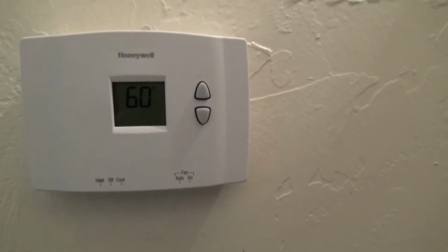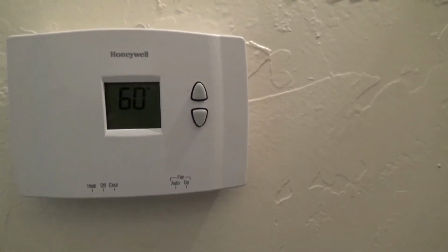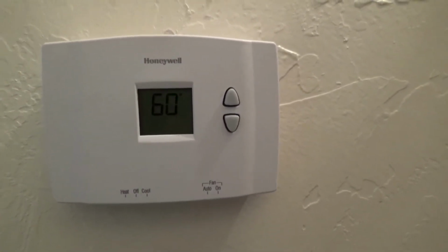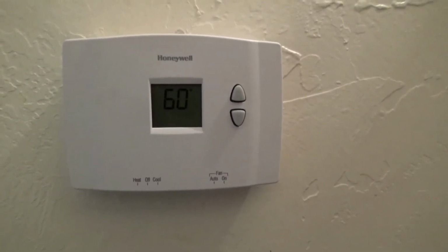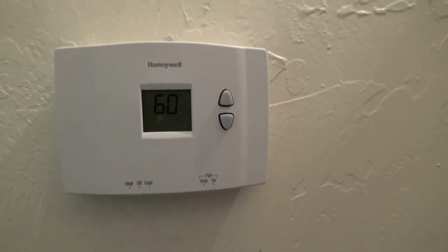Next thing to know is never turn the heat off completely. I just put the temperature really low, usually 58, 59 degrees. That will keep your place warm and will keep any water in the pipes from freezing. But we do want to winterize with the antifreeze in case the power goes out for a prolonged period of time. That's when you're at risk of having the pipes break.